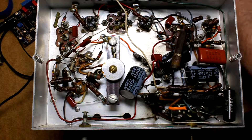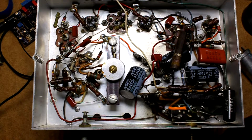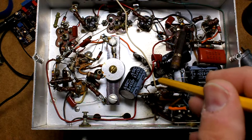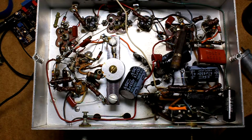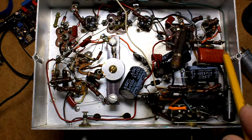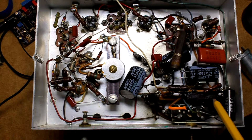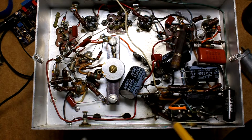The selenium rectifier had previously been replaced by a prior technician with a very small, old-looking silicon rectifier. I replaced that with a large new silicon rectifier diode, a 1N5408. There was also a 2 microfarad capacitor over here that I replaced. I also disconnected a capacitor that was connecting the ground on the chassis frame to one of the AC input lines — this was wreaking havoc with my amplifier, causing lots of distortion from that AC voltage coupled to the ground.